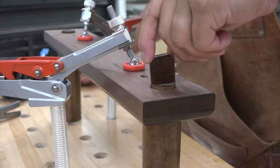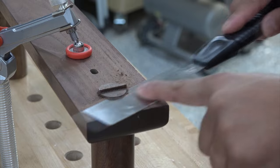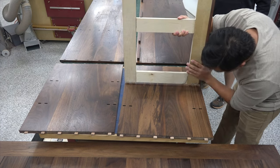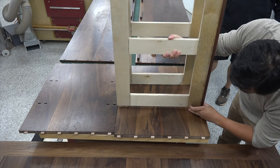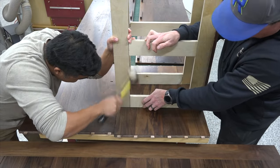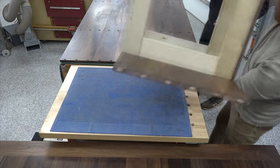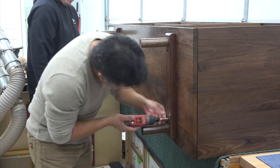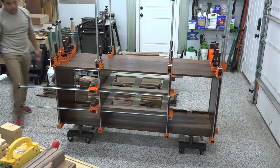I first start assembly by attaching the turned legs to the support blocks. I drive a walnut wedge into the saw kerf within the tenon until it bottoms out, then flush trim the excess. I then attach the drawer dividers to the center vertical dividers — you can see the two pairs of domino tenons attaching the front and back rail, with a slight gap between the back rail and the stile to allow for wood movement. I then attach the center drawer assembly and sides to the carcass top and bottom, and finally attach the legs to the carcass bottom, standing the piece up on the legs and allowing it to cure in the clamps overnight.